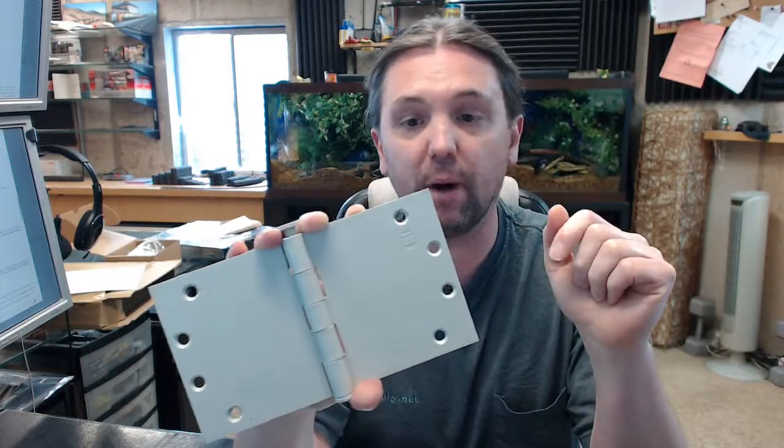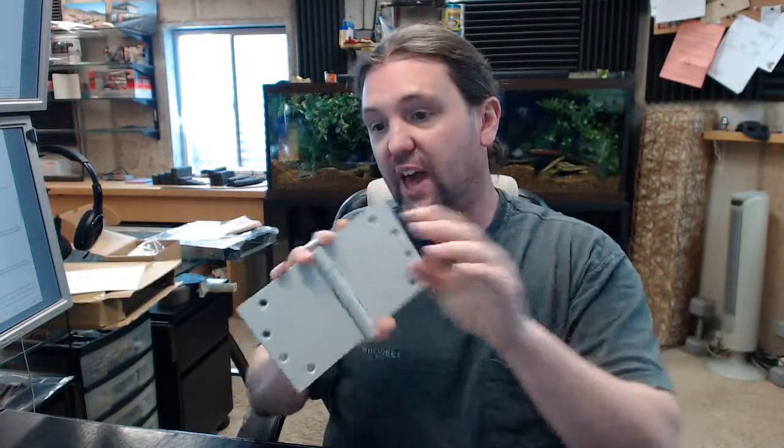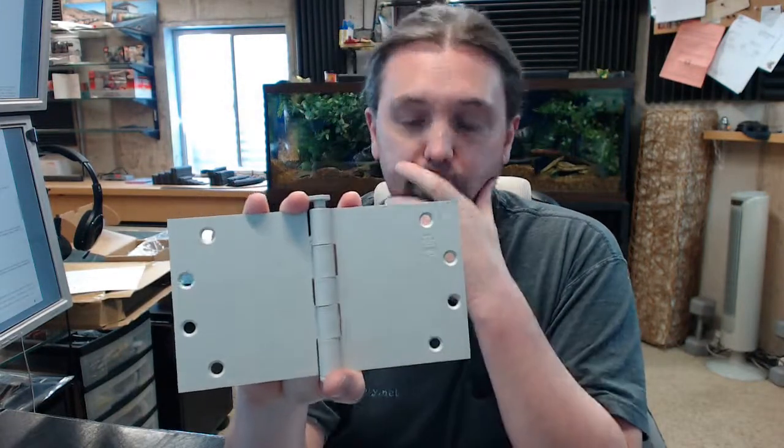Now the 600 in the part number stands for two things. As mentioned earlier, it stands for the fact that this is a steel-based hinge and that it is prime coat. That link to the cut sheet shows in the lower left-hand corner 3 columns: steel-based hinges, brass or bronze-based hinges, and stainless-based hinges, and you can see how that last number changes. So if you wanted a stainless steel hinge, it wouldn't be a 5010, it'd be a 5012 at that point. So now you can determine how your part number will change based on the needs of what you must have the hinge to be.